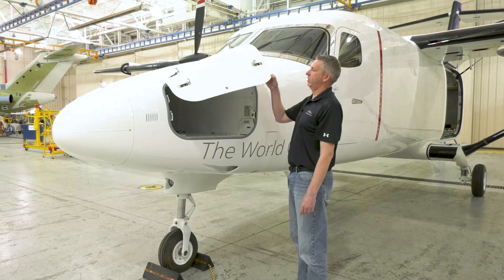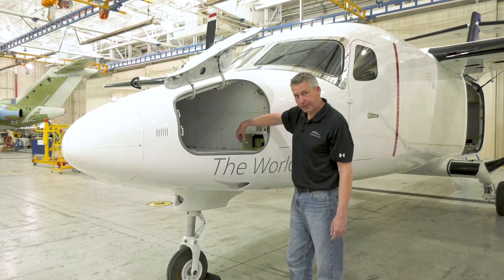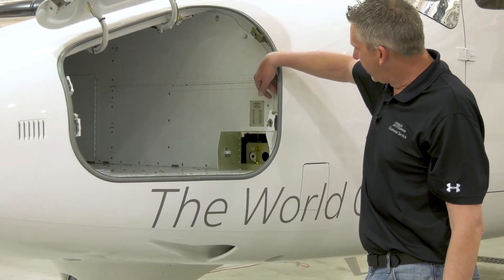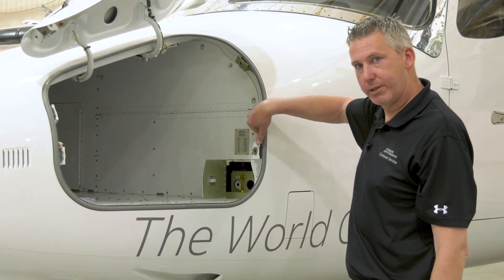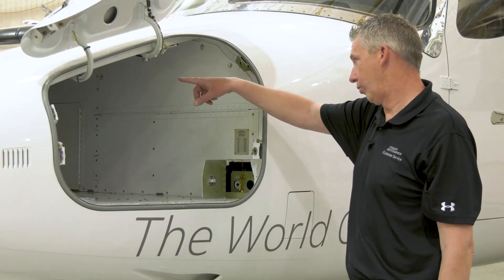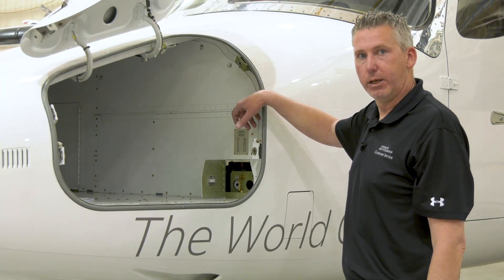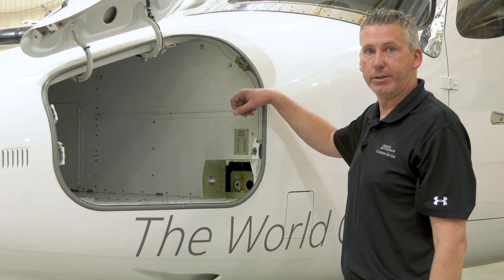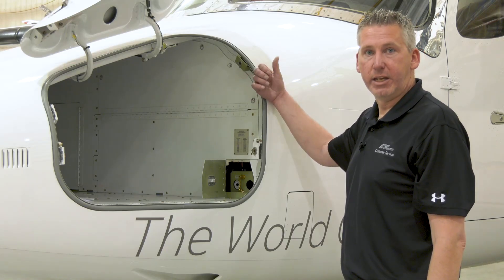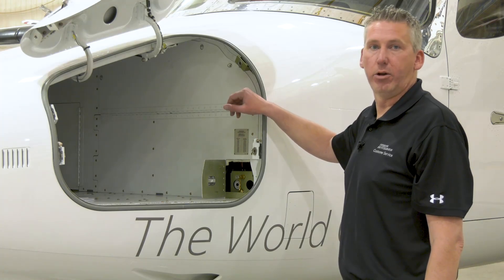The left-hand nose door opens again with the four latches. Inside you'll find the oxygen fill access. One gauge indicates one O2 bottle; two gauges indicate two O2 bottles. On the aft side of this door opening are two light switches. The top light switch is for the baggage lighting. The lower switch is the ground ops light. This ops light turns on navigation lights, the cargo handling lights — which are loading access lights for the cargo entry — and the cabin interior lights. All of that will be powered on whether the battery is off or on, as long as there's GPU power.